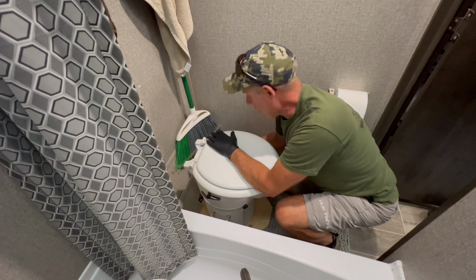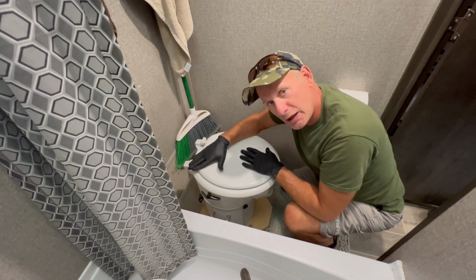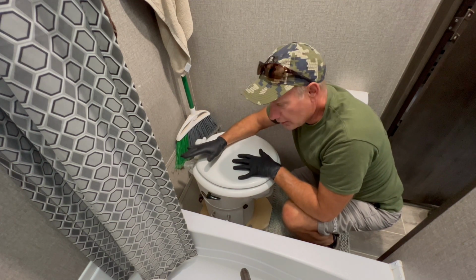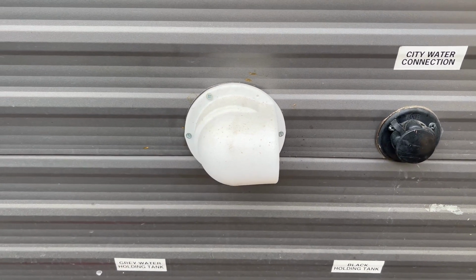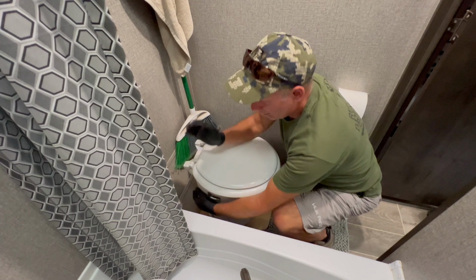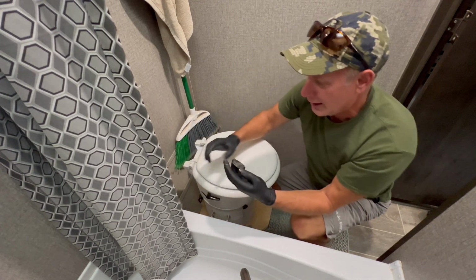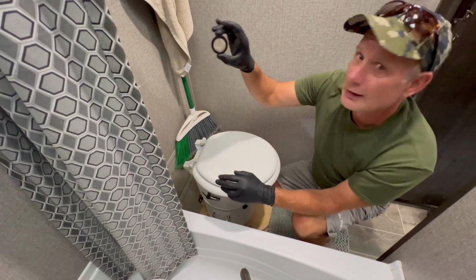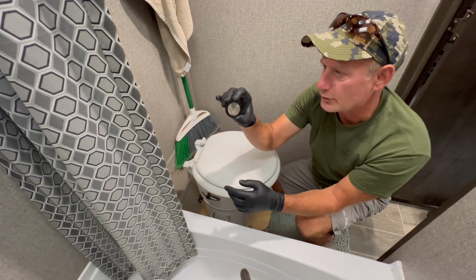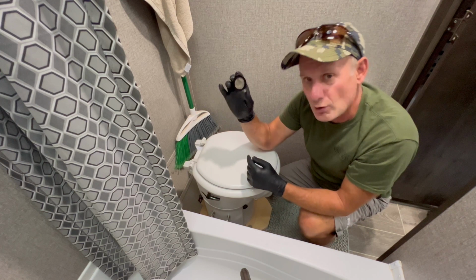Now there is a fan that constantly runs across the top of the bucket of the solids tank. It only requires 3 watts of power. You can barely hear it from the vent outside. And there is a little screen where the air does draw through here, and I always check that. And see, you can see the dust in there. I'm actually going to just give that a rinse. This is the main air draw that comes across, so you definitely want to keep this clean.